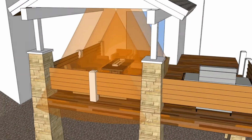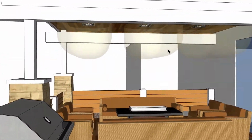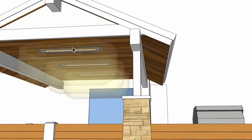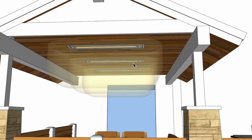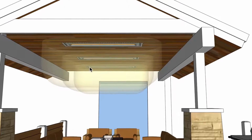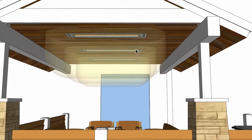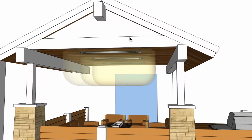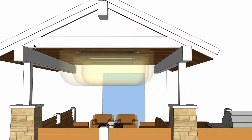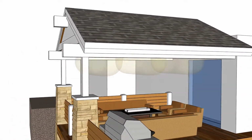Just a quick other option here. I'm going to look at the clearances to combustibles. I did look at placing 1 unit here, 1 unit here, the shorter units, the 5,000 watt units, for instance, but I couldn't meet the clearances to these beams, so that's why I didn't choose to use the 5,000 watts and put 4 5,000 watts inside this space here. And again, that's just based on the fact that I believe the rafters are in this orientation, so they're running parallel with this beam here.